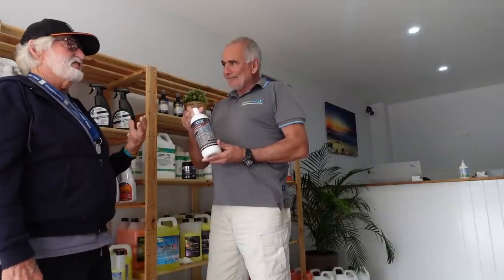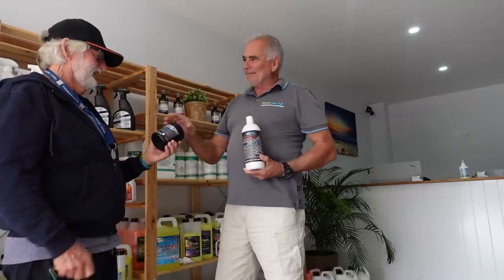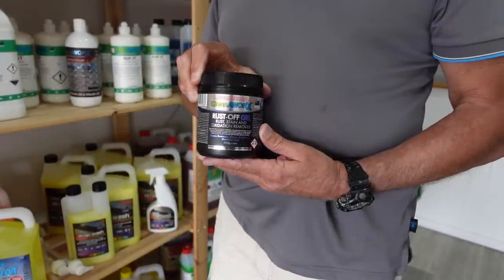Now, look, the other thing is, I've got a little bit of stainless. It's a bit rusty. Have you got anything I can use on that? You're at Cleanerworks. We've got everything. You're going to use my rust-off gel. Okay. Brush it on, 1 to 2 mil thick. Give it 40 to 60 minutes soak time.